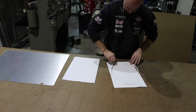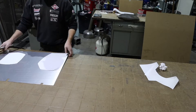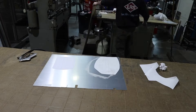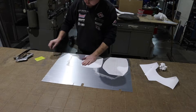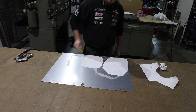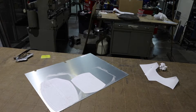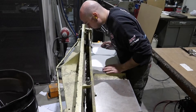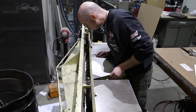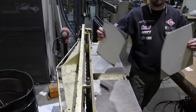We're starting off with my templates as usual. I know a lot of you folks have been asking for the templates and I will be releasing them soon after I'm done building all my metal parts for my costume, so just give me some time. Right now I'm pasting my templates on 0.053 aluminum, going a little thinner this time. I'll get them sheared out, shear my flats, then take it over to the bandsaw and get my parts all cut out.